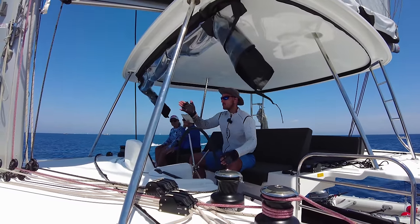If you're not sure, you can always also furl the jib, because downwind it's very easy to furl the jib. Start the engines before that, of course. So start the engines, furl the jib, and then do a tack upwind, come back, open the jib again. That's another method. But definitely don't just turn the wheel when having the mainsail open a lot and the jib sheet released, because it's just going to go zoom on the other side, and probably break everything.